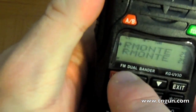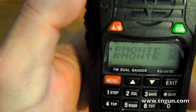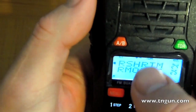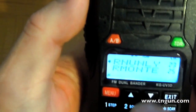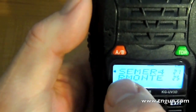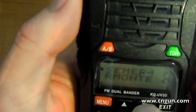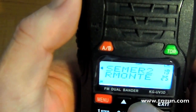With 126 channels it's kind of hard to remember, so I've got a short naming system: R is for repeater, S is for simplex — meaning directly one radio to the other. Then I name them, like the Mon Eagle repeater, Short Mountain which covers most of Middle Tennessee, a Nunley repeater near me in Hickman County, Clarksville with numbers if there's more than one repeater in a town, and simplex emergency channels — I've got four of those listed in my repeater directory for direct talk in emergencies.